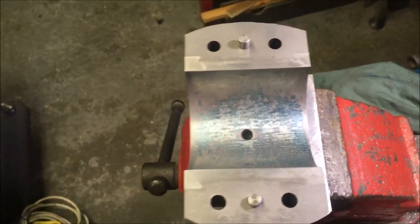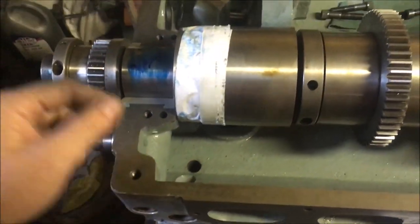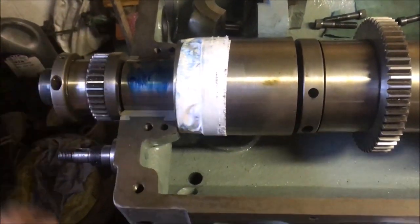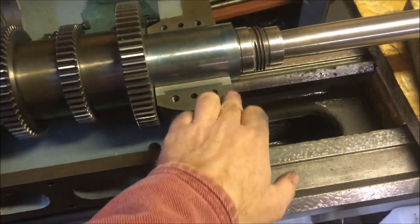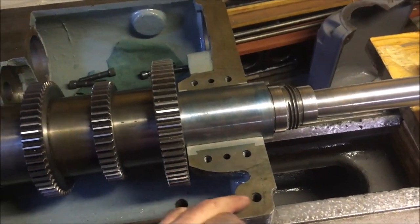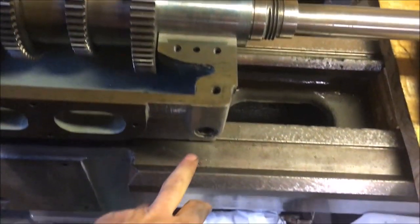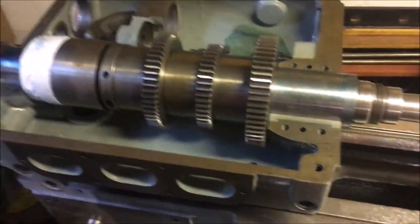So it's rinse and repeat with the back one now, and cut shims, print, keep printing it until you get full coverage, and taking the shims out as you need to. And the final job will be basically making up some new shims, either a thou, thou and a half, or 2 thou, up to 3 thou, depending on how much clearance I think I'm going to need. That's to be decided. And then I've got to find some felting to make the oil wicks.